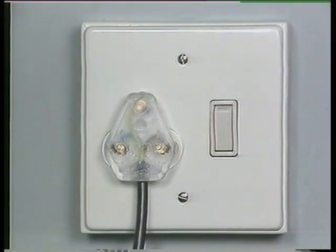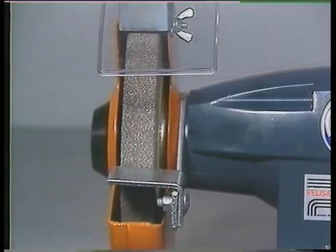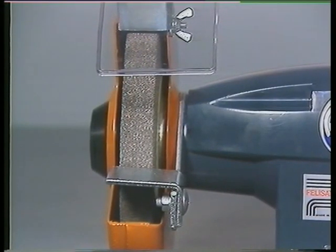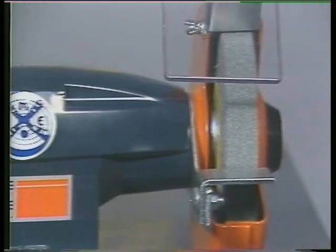Power is supplied via the shop supply by an electric motor, which carries the two grinding wheels on a common shaft. One wheel will usually be a roughing wheel, that is a coarse grit type, the other a medium or fine grit wheel.